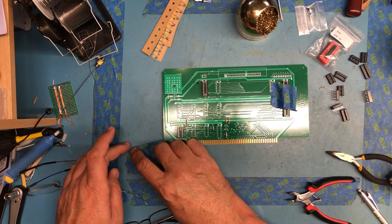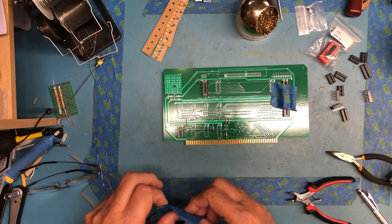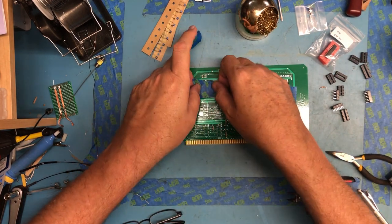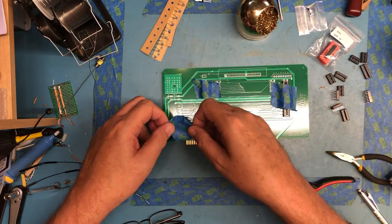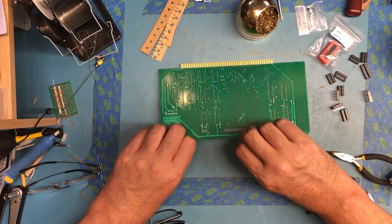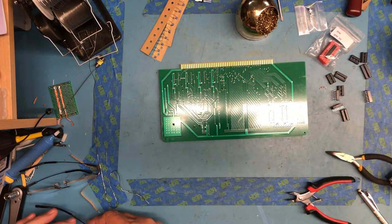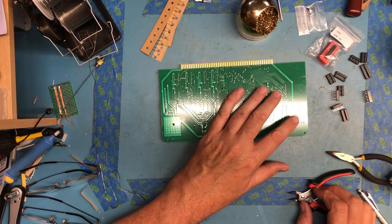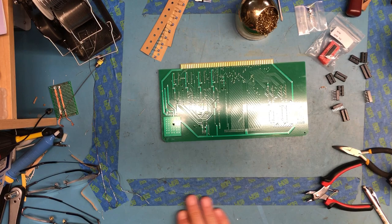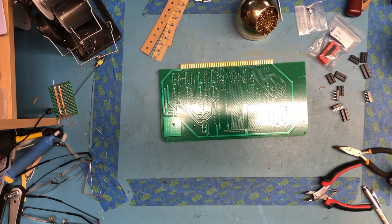How well this tape sticks to the work surface. My normal thing again about getting sockets out towards the four corners of the board as best I can, so the board will actually just sit level for soldering. And you know the procedure, if you've been watching my videos: I'll solder two outer pins, push them up flush with my finger while reheating, and then finish soldering them. So we'll jump in and do that next.